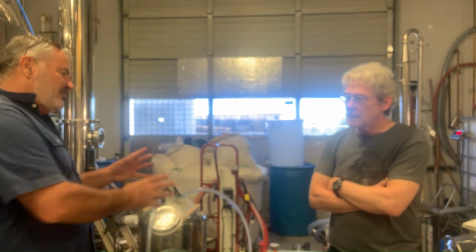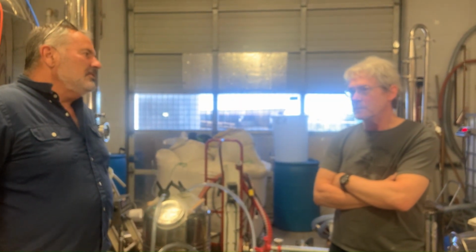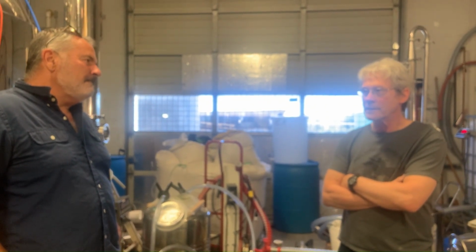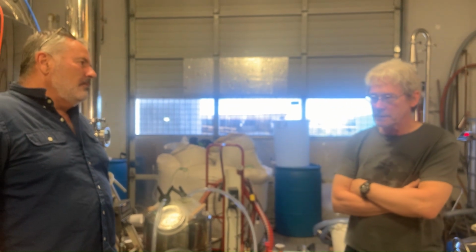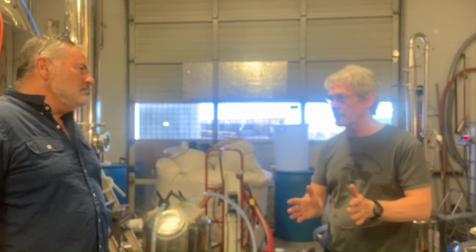So that comes through even though it's been filtered and everything? Yeah. I mean, you distill it quite a lot. You need to distill it right to 95%. Another law of making vodka is it should always be 95% before you start to dilute it. Okay. But even at that point, you're still getting a little bit of the flavor coming through.